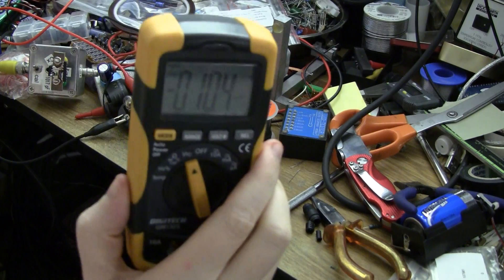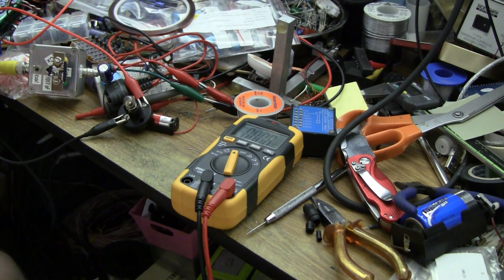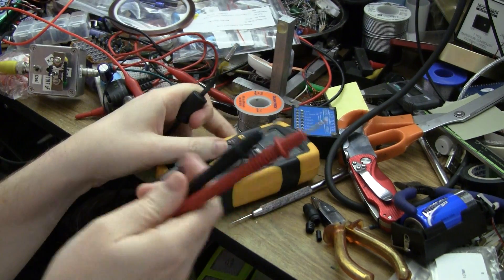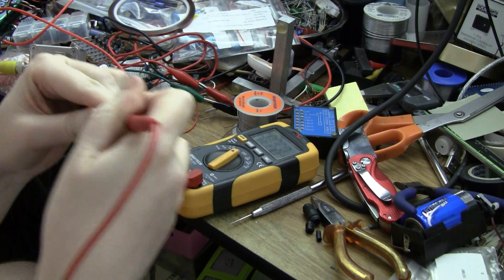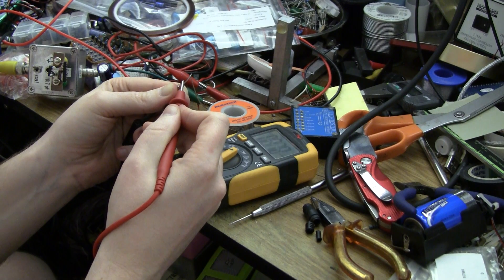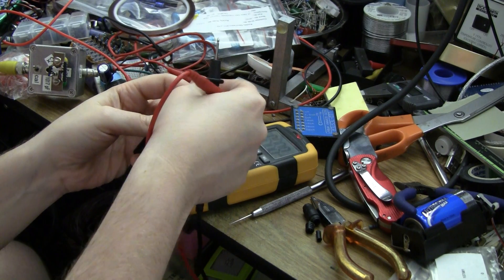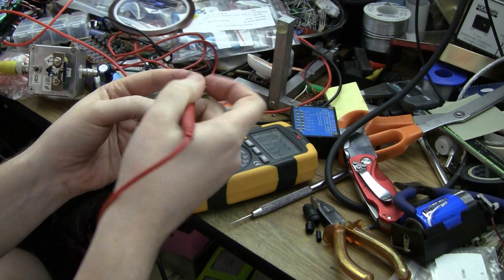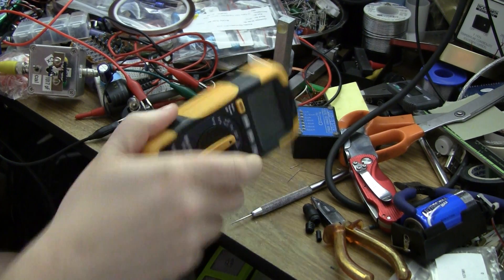What I will do is just check that it is, in fact, wired the way I believed it was. I didn't bother to cut up the old plug. I very much doubt it would be anything other than how you'd naturally expect it to be wired up, but you never know — it doesn't hurt to spend two seconds with the multimeter just to make sure it wasn't screwed up. And of course it's one of those recessed plugs that's bloody hard to get into, so we just shove a bit of solder in it. Many switch modes have issues if they're not loaded very well. 18.82 volts — close enough. If I loaded it down it would probably be closer to whatever it's actually regulated to.